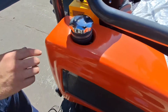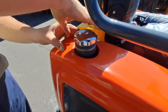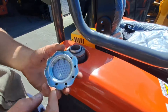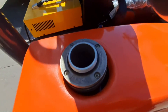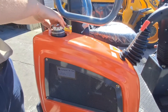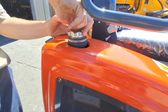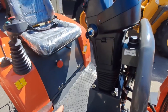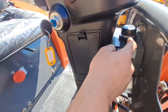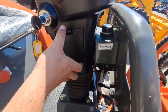This is your filler cap for your hydraulic oil — it is also a breather. You'll see on the inside of the cap there are breathing holes, and there is a strainer inside so nothing gets into it. Right here you have your brake fluid level. It's normal DOT 4 brake fluid. You can just open it up just below the neck — it's approximately here in the bottle where your level should be.